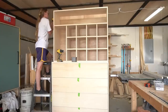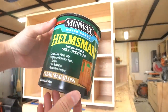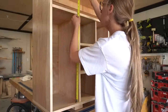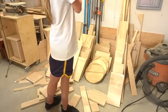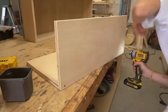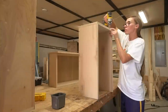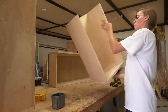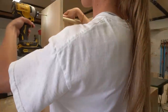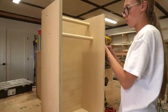Not ideal, but it's going into a nook and you'll never see the screws. I puttied all the screw holes, sanded, and applied a couple of coats of clear coat. Then I added the final piece — the tie rack. The friend I was building this for has a lot of ties and wanted somewhere to hang them and tuck them away. I rummaged through my scrap pile to find pieces to cut down for a small box. Instead of a top panel, I cut three pieces from a dowel rod to screw into the box as racks, carefully measuring each side to make sure they were installed square and level.